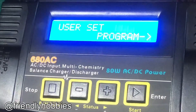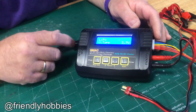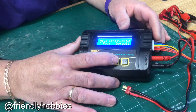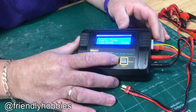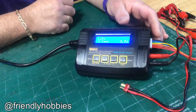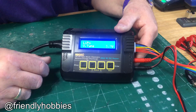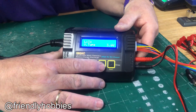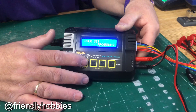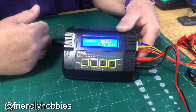The program key gets you into different chemistries. Say I wanted to do a LiFe battery — I press start and it takes you right to the LiPo menu, and if you scroll over you can do LiPo, lithium ion, LiFe, NiCAD, and set peak detections, peak charge, and discharge. A lot of people are confused on how to do a lithium ion battery. In the LiPo program menu, press start to change the voltage — scroll up to lithium ion, or further to LiFe batteries. Once locked in, the menu will say LiFe, not LiPo.